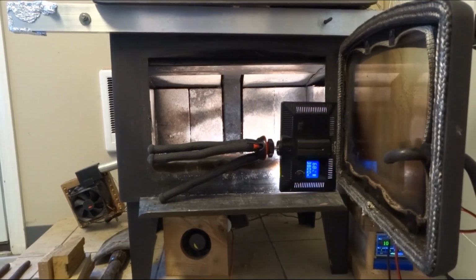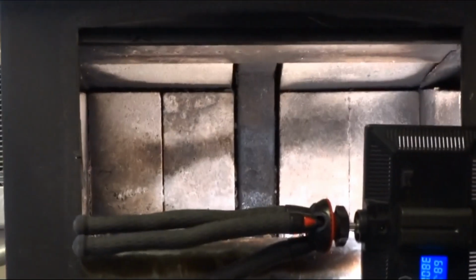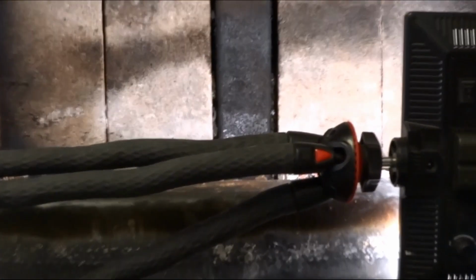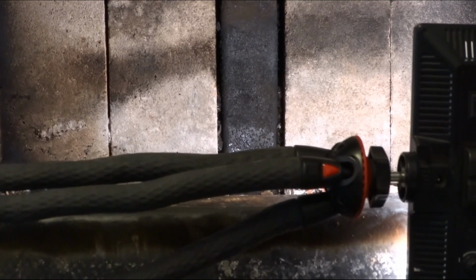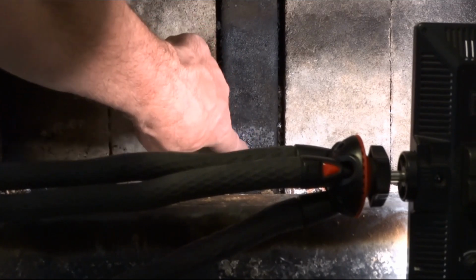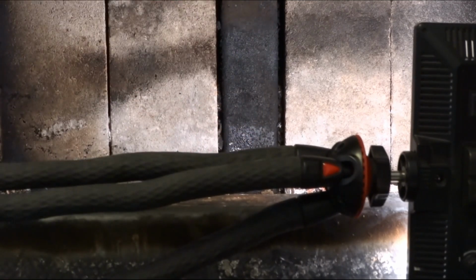Getting our wood stove started again. I had taken quite a bit of it apart, and I also had some ideas for making it work better. This S244 stove from SBI does not have any low combustion air vents into the fire chamber. My idea was to put some small holes in the riser tube at the back of the wood stove. This is the tube that takes air up to the secondary burner area.